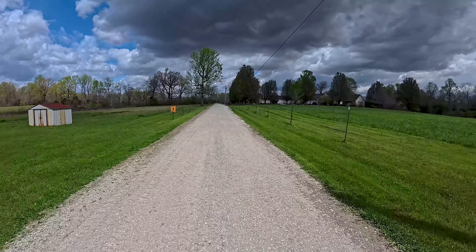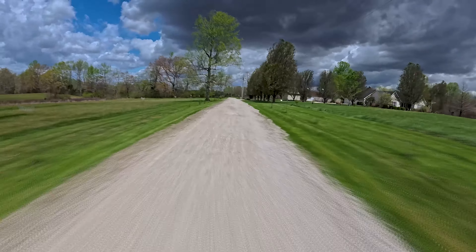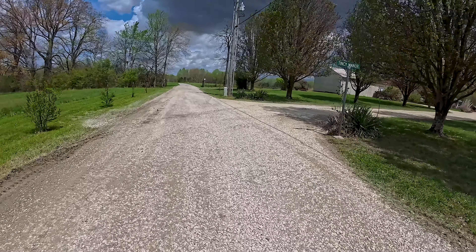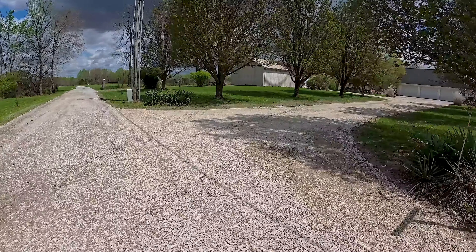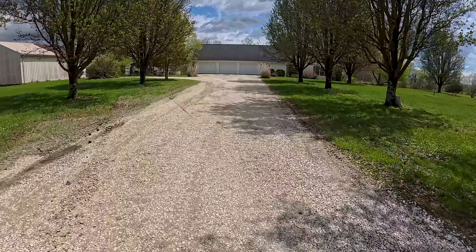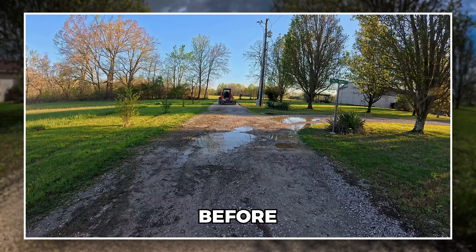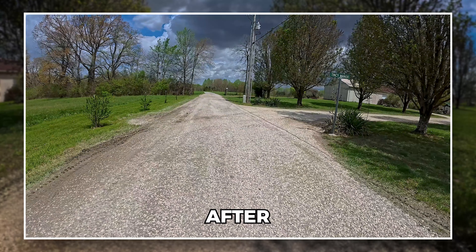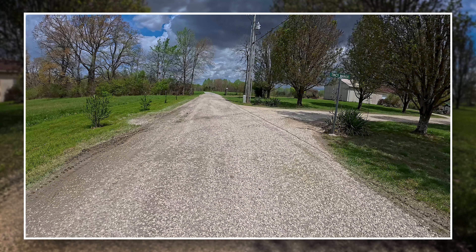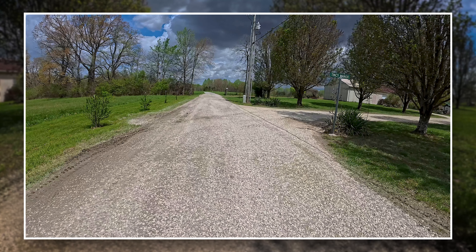And there you go — that's how it's done. The right side is slightly higher than the left; you may not be able to tell from the picture, but that's going to allow the water to move off the driveway and not create potholes. You can see how we've created a slope that comes from the private driveway and ends onto the grass of the shared driveway. There's how it looked before — and this is what it looks like now. Hope you enjoyed it, thanks for watching.